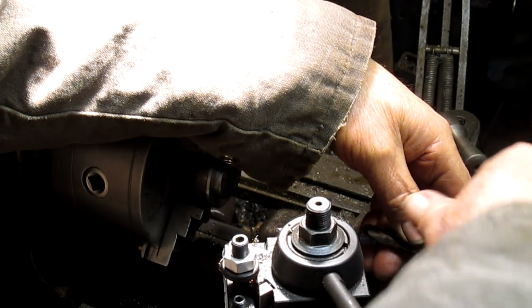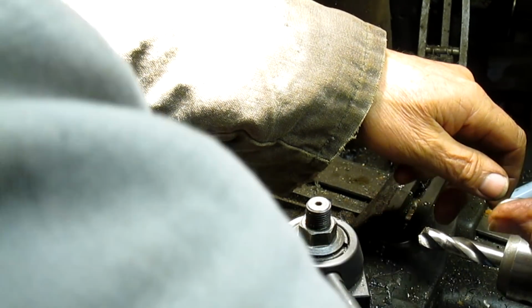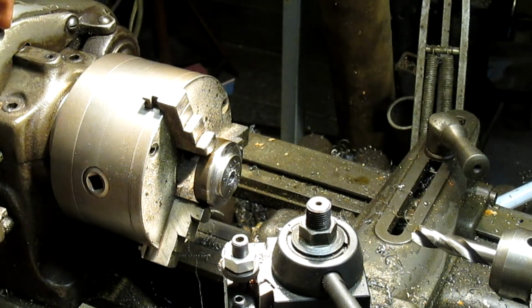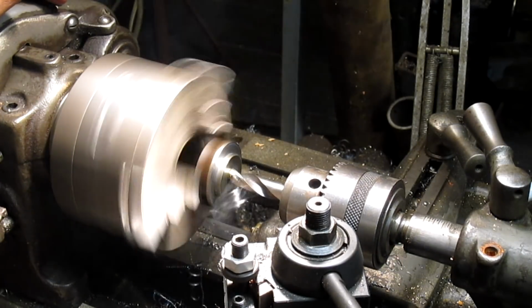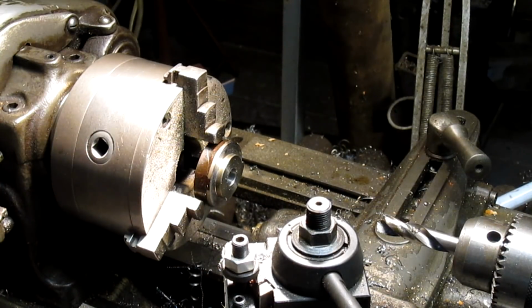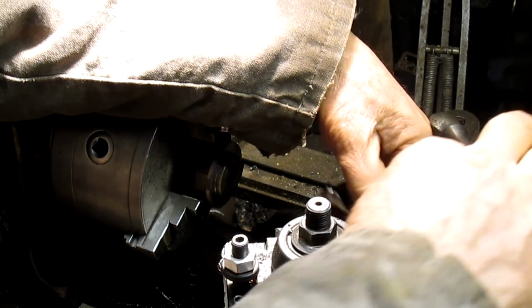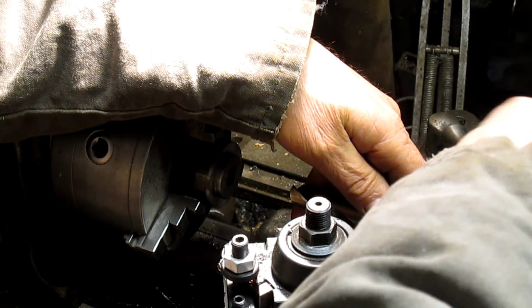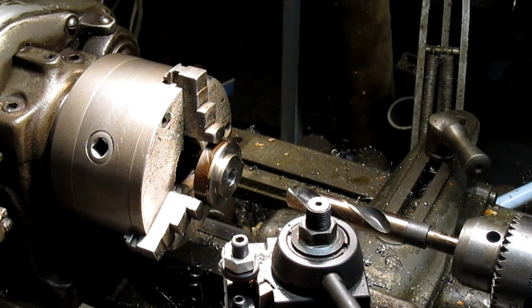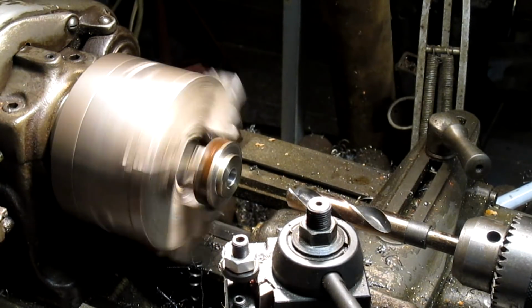And because this is a really weak lathe, we can't make too big a jumps at a time. A good lathe, but it hasn't got a lot of beef. And next jump up, we'll take it to just under 3/4 because we want to get that hole nice and straight. So we'll go ahead and come back in and bore it. So 11/16, and let's slow this thing down a little bit. That's better.